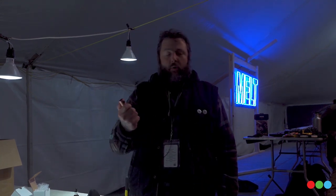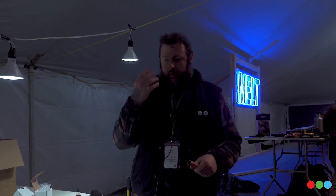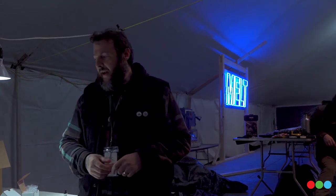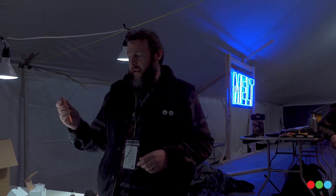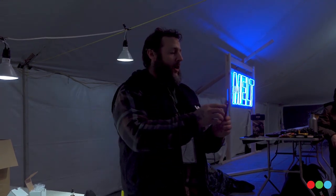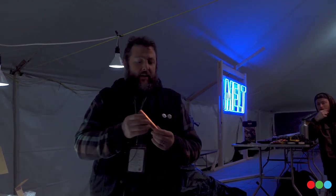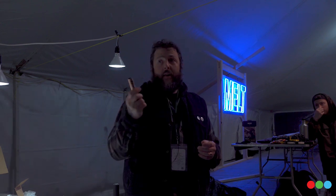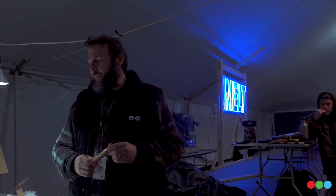Drilling it, however, can be more complicated. I have a little drill press and wear gloves and, you know, eye protection and just do it that way. The benefit of this is that these last a really long time. Copper is removing from this and working its way to your piece. And this is getting thinner and thinner, and it gets so thin that you'll start to see holes in it, and it's time for new copper pipe at that point.